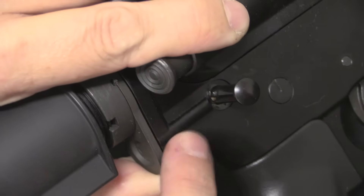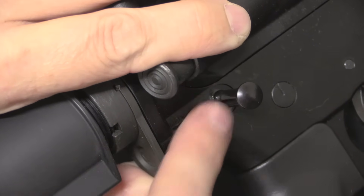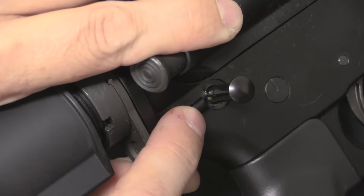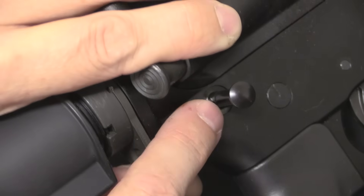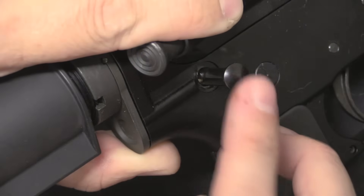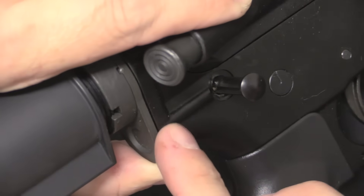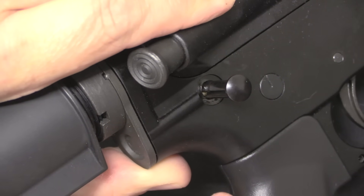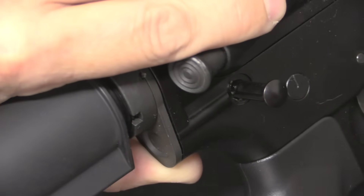In order for this to work, you have to have a way to install the detent and prevent it from coming out the front of the hole. So this is some of the engineering cost of having captive pins. We have to make arrangements for a hole accessible from the back — it's a two-diameter hole, larger in the rear and slightly narrower near the front, so you can put a little neck on your detent. You put the detent pin in from the back, and it can only protrude a certain distance, putting a stable amount of tension on the pin. It's definitely an additional engineering cost to having a feature like captive pins.